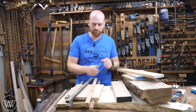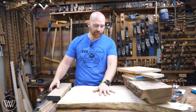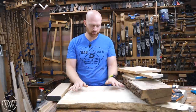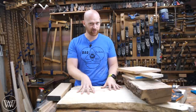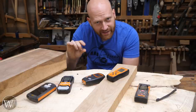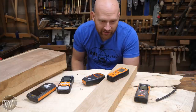That's great if you just milled up the lumber and you're trying to keep it flat. But what happens if you just got rough sawn lumber from the mill and it still needs to be dried? That's a whole other bugaboo. How do you know when it's actually dry? How should you stack it up, how should you store it, and what are some other things you can do to know when it's ready to work with? Usually when you ask how long you should dry the wood, you're going to hear the standard answer of every inch is one year of air drying. And that's a good rule of thumb, but it is wildly inaccurate depending upon where you're drying things.